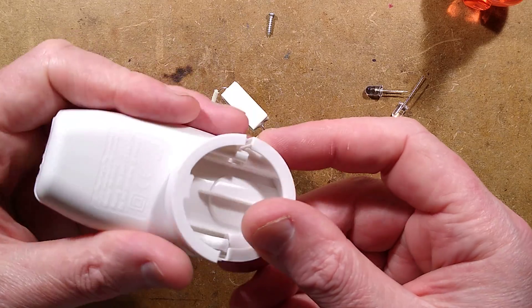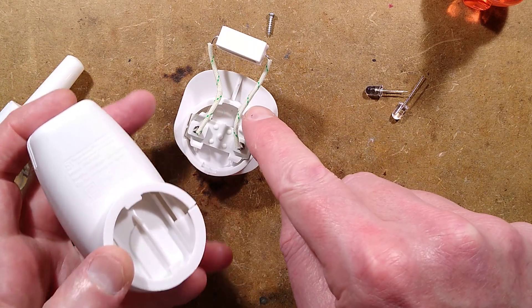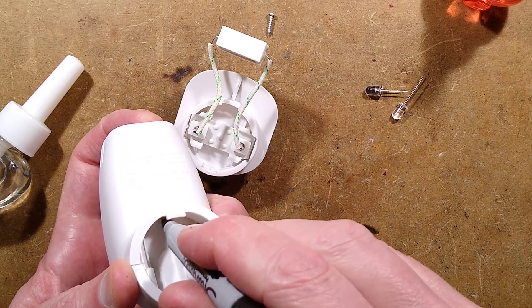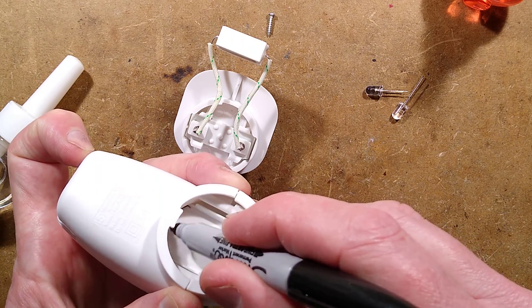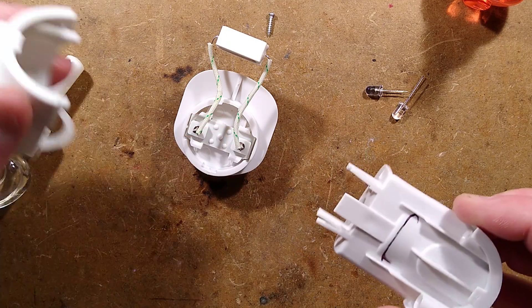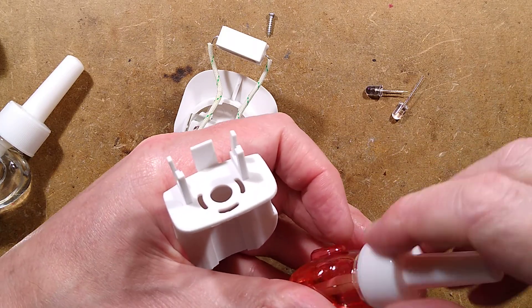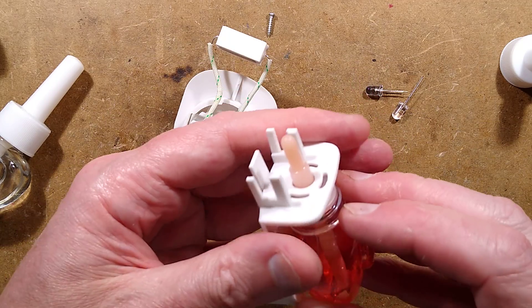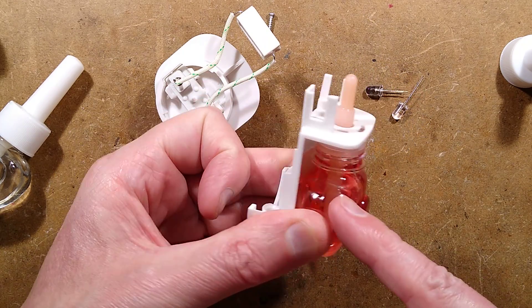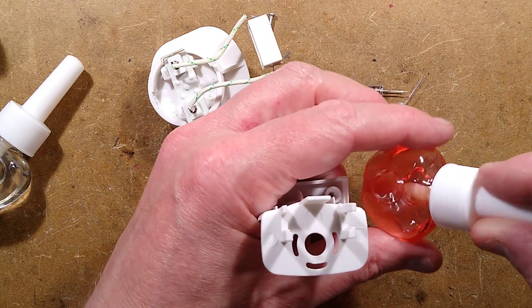I'm going to draw in here where I've got space to put the LEDs. All I'm going to do is put the LEDs in inverse parallel with one of the leads. To make sure I don't encroach on the case here I'm just going to draw a line, then I shall drill a couple of holes for the LEDs. I'll also hold the bottle in to see where it actually hits so I don't put LEDs in a position that's going to obstruct the bottle. There's not a lot of room - basically close to the top of that line is where I'll be able to fit those LEDs.